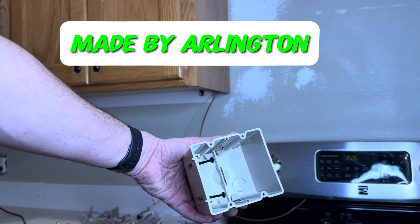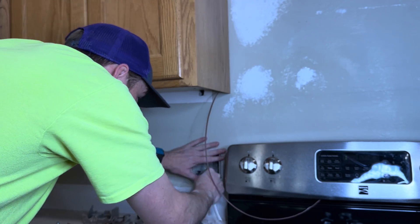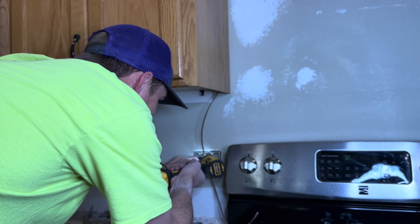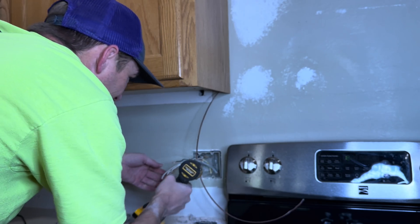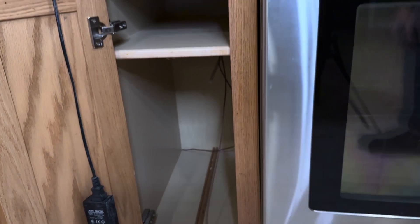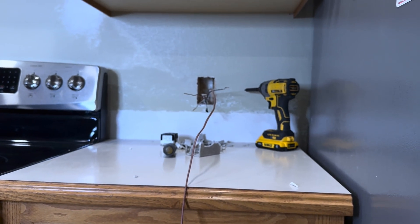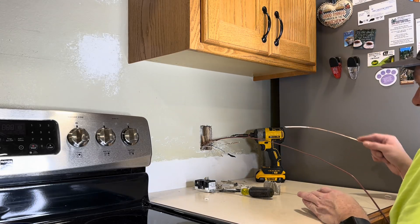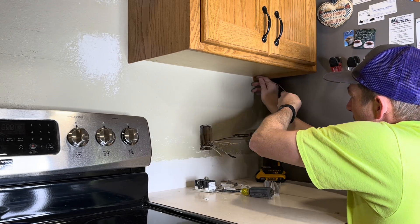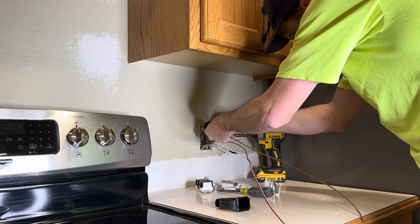The type of box I'm using here is a smart box - you'll notice it has those screws right on the side of it. I'm just poking those wires through there. That box is really nice because it fits the exact hole that that nail-in box was, which is why you want to keep the integrity of the hole. I had already fed the wires where they needed to go - that is the cabinet right below where I was working. So I did the same thing and I'm just installing a driver there. I also ran that wire behind the range and through that cabinet right up into that hole, pulling that box out where the outlet was to fish up to where I want that wire to feed the LED tape light on that cabinet.